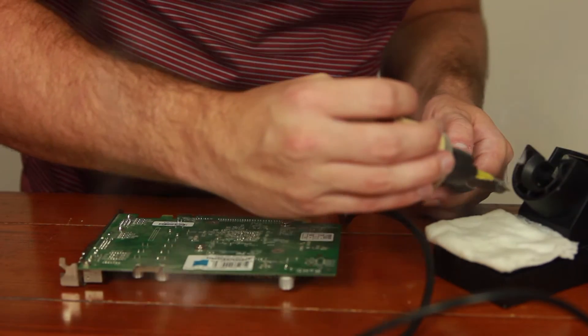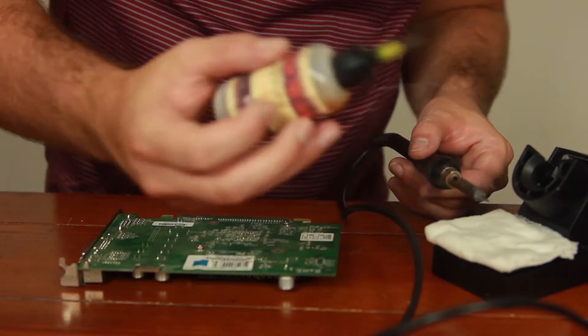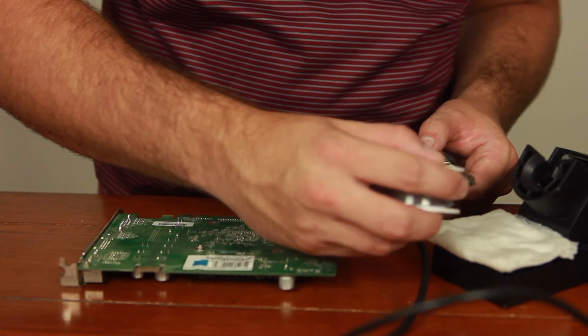It's all going to be right down there in the description. Other than that, we will be taking a look at the back — there's really just two prongs on the back of these capacitors. We'll un-solder them, pull them out, plop the new ones in, solder them back in, and hopefully it works. We'll put together a computer and see if she goes, or it lets out more smoke and we get sad and start again, or use another video card.